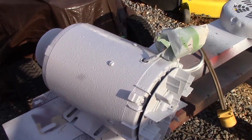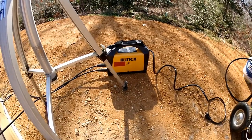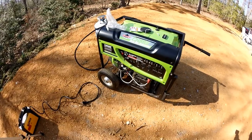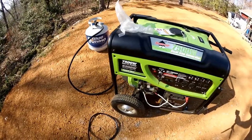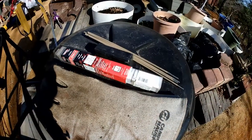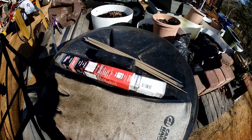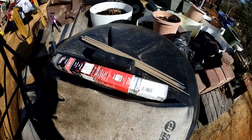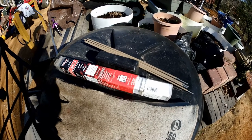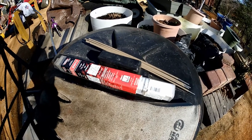Now for the hard part — wait until tomorrow until it's good and dry, then put it back together. Today we're going to use this new clutch 110-volt inverter stick welder and see if that gives me any better results. We're also going to drive it off this generator running off a propane tank — I've never run gasoline through it, so I don't want to gum up the works with ethanol, especially since it sits most of the time. This welder takes 1/16th up to 3/32 inch rods. The 3/32 is probably going to give us a better result. I've practiced a little on an old disc brake rotor — it's sticking a little, but don't laugh, I'm a rookie. This should give other rookies thinking about this welder a good idea of what you're up against.